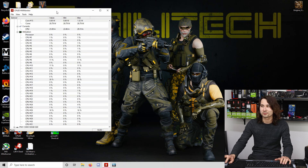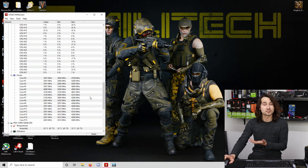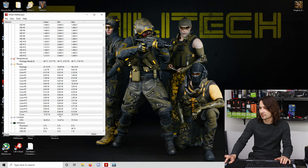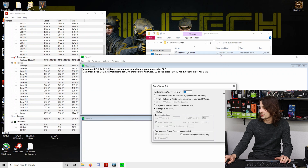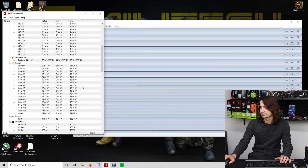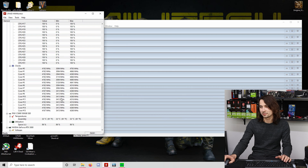Let's quickly demonstrate what happens when you run into a motherboard bottleneck. Right now all our CPU cores are banging out — one hit above what 3950Xs are even advertised to hit, 4.7 GHz. It's doing really good. Let's check our wattage. Let's go ahead and fire up Prime95. You can't really hit small FFTs on a 3950X — it will normally just crash. So I go with smallest FFTs and hope it doesn't crash. We're pulling about 213 watts, 4.2 GHz all-core. Not too bad, doing really well.